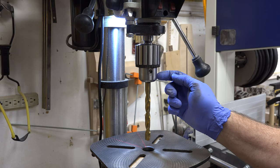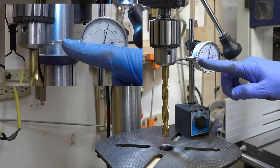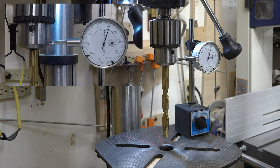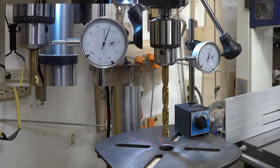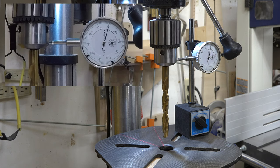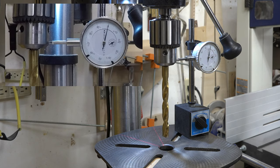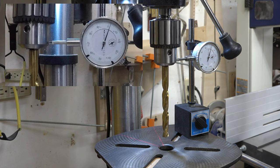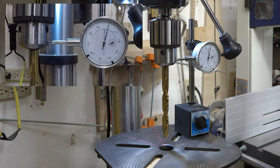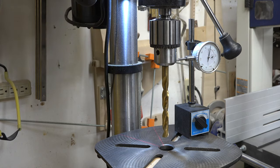There's no guarantee that this drill bit itself is true, so the first thing I'm going to test is the edge of our chuck. With everything set up again with the dial indicator at the edge of the chuck, we'll carefully turn it and see what we get — two thou, and then back, one thou, back to zero, and back up to just a hair over two thou. So let's check it now at the actual bit itself.